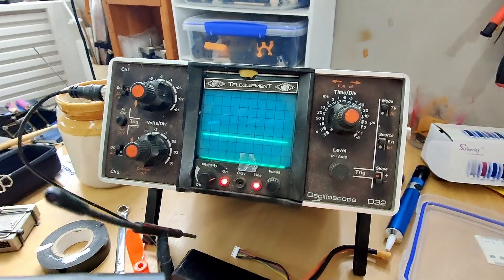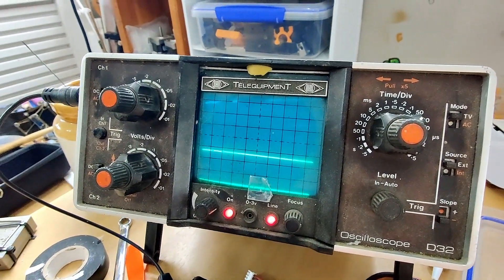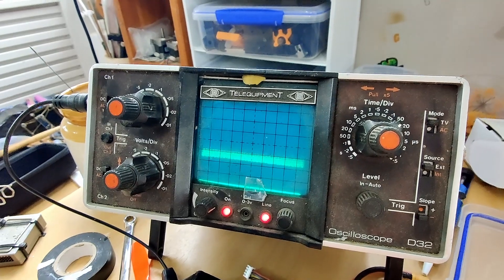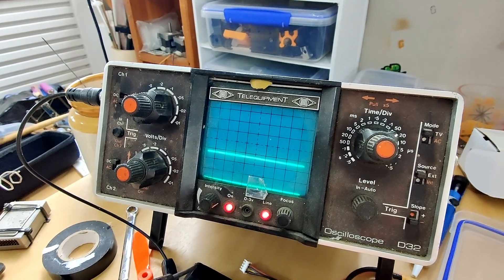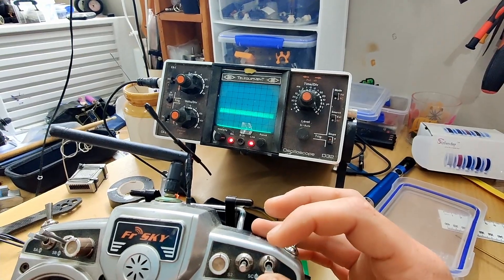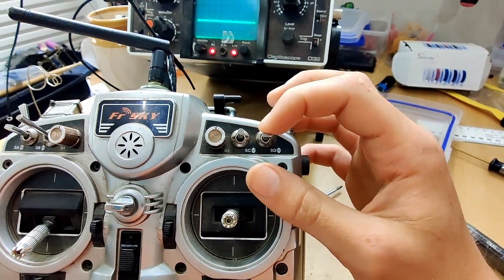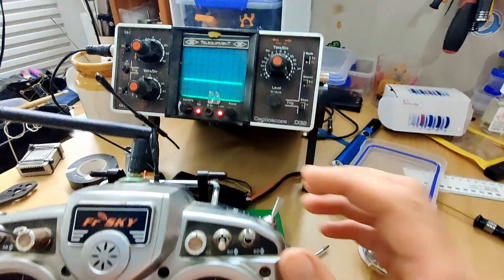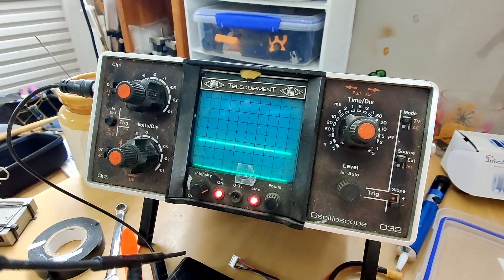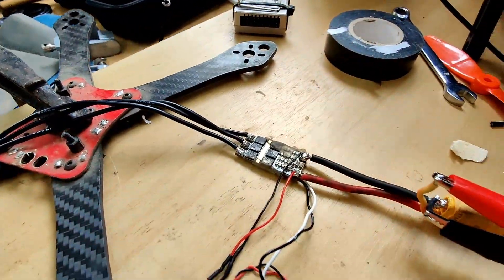I'm not sure what PWM rate I'm running here and I haven't crunched the numbers, but it's a really high frequency. The other thing going on is when I start the motor — watch the spike. See how it spikes quite a bit above the RMS noise, and then when I increase the RPM you get that massive spike. Not only do you get that spike under acceleration, but when I click the switch down you can see it makes a massive spike as well. That's only going from about 10% throttle up to about 35–40% — a tiny throttle change — yet even on deceleration it's spiking around about three volts above the VCC input, and that's just one little motor and one little ESC with no capacitors.